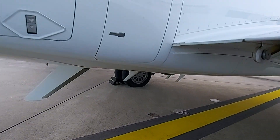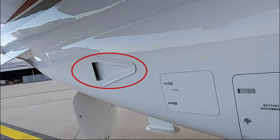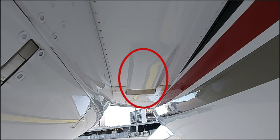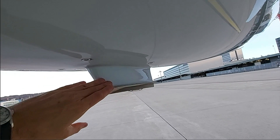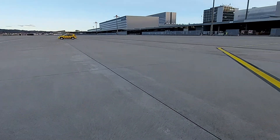The hydraulic panel does not need to be opened for the walk-around, but you do want to check the tail cone air inlet scoop for any blockages. Above here is your pre-cooler, and here are the engine drains — check for any leakage. Sometimes if you overfill the oil it drains out here.